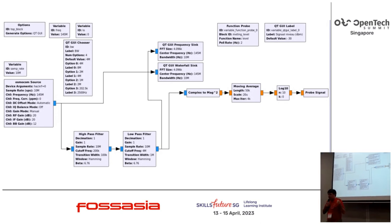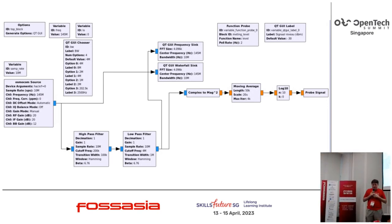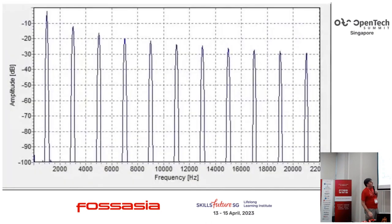Okay, this is awesome. This gives us how much power is coming out of the antenna socket, with a bunch of qualifiers. That's not enough. It's important information, but it's not enough. The reason is you need to know how much of that power is present in the fundamental, and how much is present in harmonics. If your radio looks like this, don't ever connect it to an antenna.